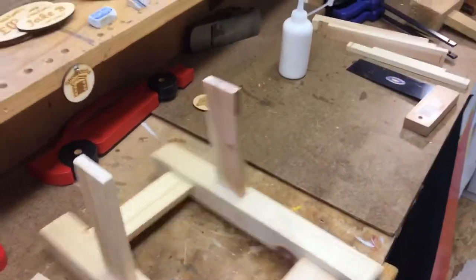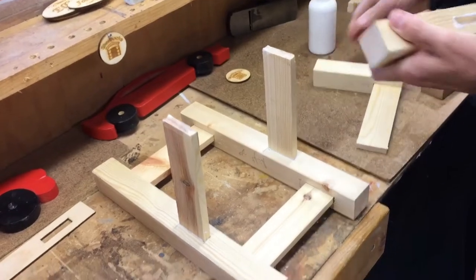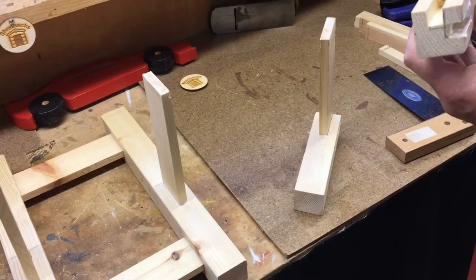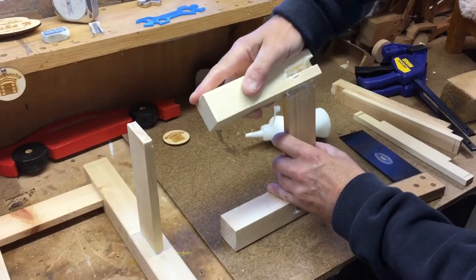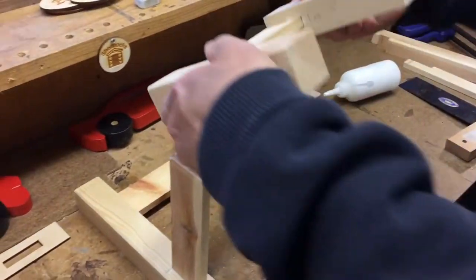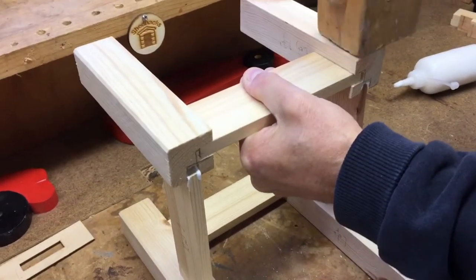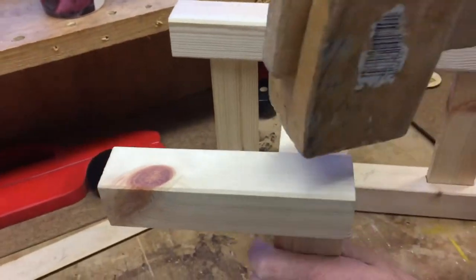Now I've got to get this right — it's got to look like a chair, so line it all up neatly. Don't glue it upside down. The gluing part I quite like, but the gluing can go wrong. Don't glue it too early — assemble it dry first. That means assembling it without glue to see if it all fits. Can you see that joint closing up? I'll turn it on its side and check that they're knocked in neatly.